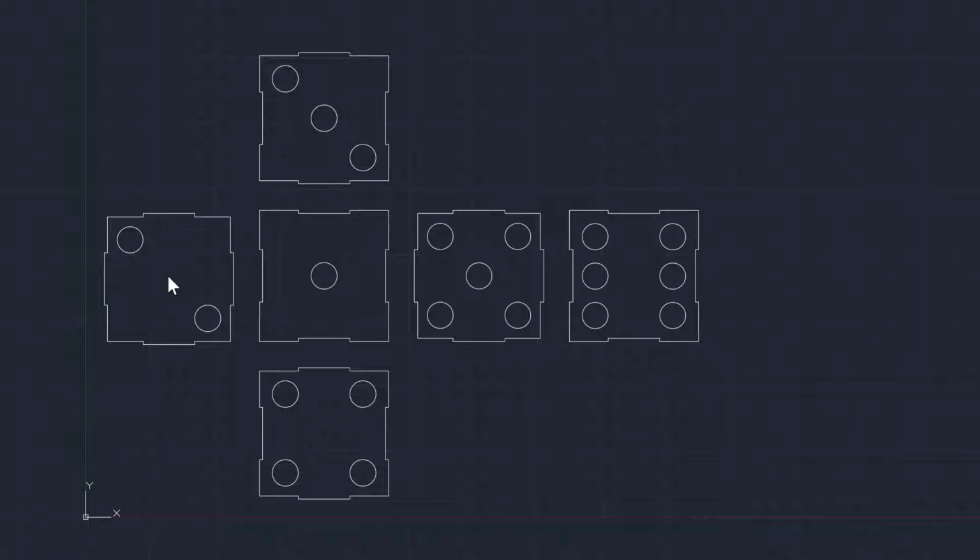The left view and the right view, 2 and 5, also have the same joints, and 3 and 4 have the same joints. And so as you can picture, these views wrap around to form a square looking front on, and then these two pieces, 3 and 4, are added in. And a couple important things here. One, that the views as they go across align. And when we talk about how do you draw these, we'll demonstrate this. And then also vertically around the box, these also align.